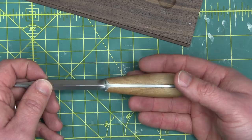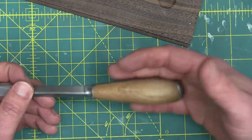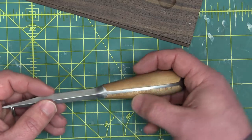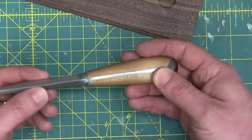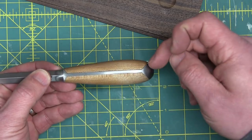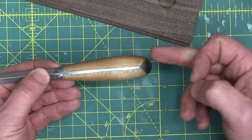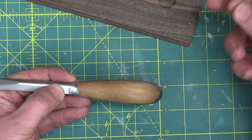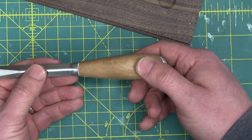Just in the past couple of years, I've been a convert to wood-handled screwdrivers — feel great in the hand and excellent grip. One problem we see here is some edgewise grain shown, so we'll have to watch that. The other concern I have looking at this old design is these wedges — if you impact it here and it wants to cock over or squeeze over, it might pop this right off or crack it. So I have to test that a little bit.